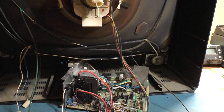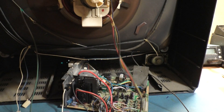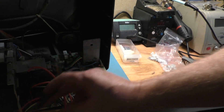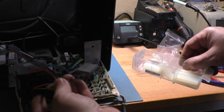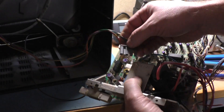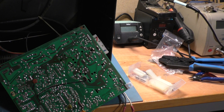If worse comes to worst I have a dedicated K7000 yoke sitting right here. Ideally you'd just desolder the wires from the original yoke and solder them onto the K7000 yoke connector. I've figured out a solution — I actually had the correct yoke connectors in my miscellaneous parts bin. I grabbed one of those, pinned it up with the crimper and sockets, and installed the correct type of connector style. We'll go ahead and plug that in.